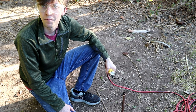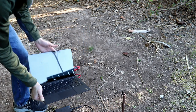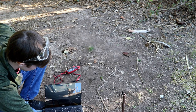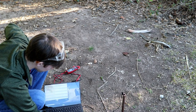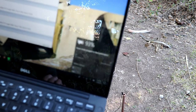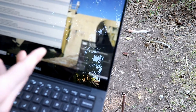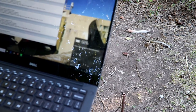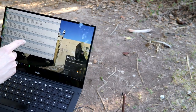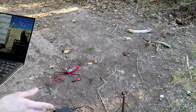I've connected a laptop computer charger in the same configuration to power my XPS 13. Getting the ground rod alligator-clipped together and connected — it appears the computer is charging. Zooming in closer, it says it is connected and charging indeed. I'm also running Prime95 to maximize the load to see if there are any dropout issues where the charger browns out and turns off, and there do not seem to be any problems. We are in fact powering a laptop computer at full Prime95 test load through the earth itself, using the earth ground as a return path for AC current.